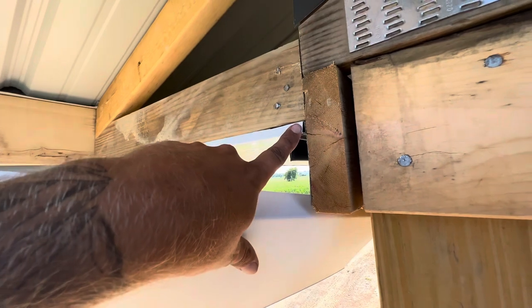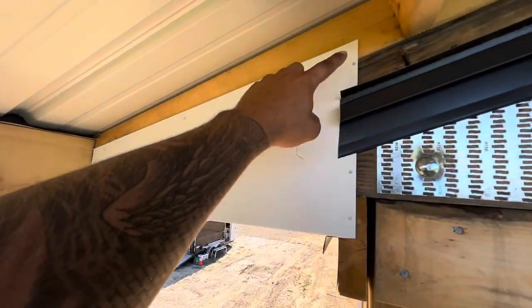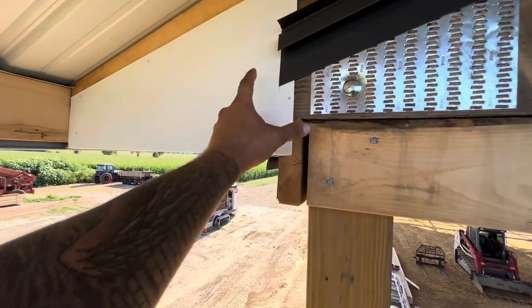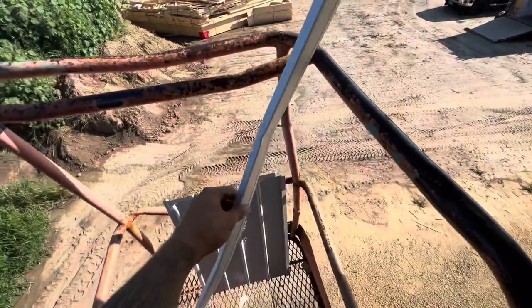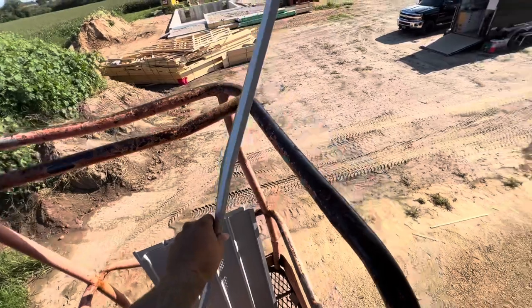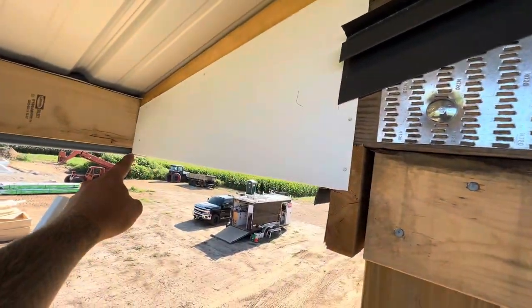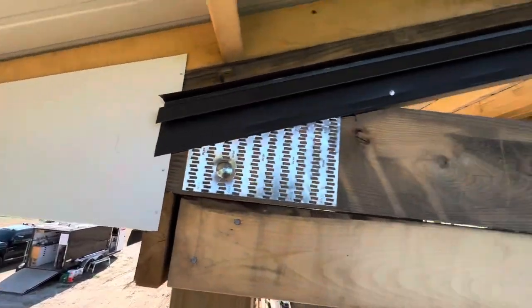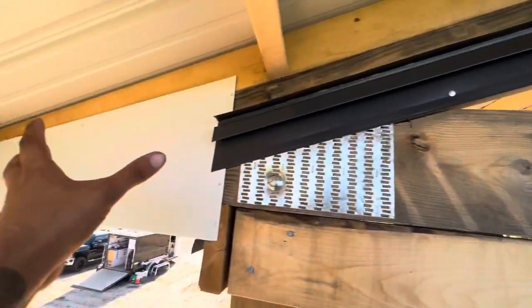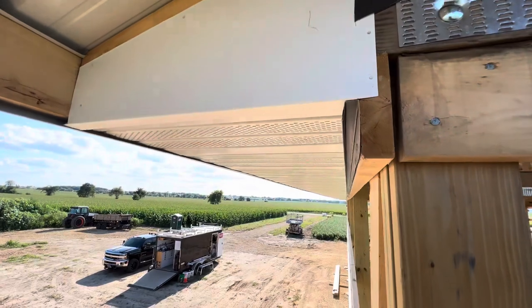It's just a little tight right here but we'll make it work. The panel is fastened off — a couple nails there, a couple going up the top, and some in behind where the corner will come up. Now I'm going to take some scrap regular half-inch J-channel, cut it to fit from here down to there, tuck our soffit piece in, and work this soffit up so we have a really nice clean transition from our rake soffit to our flat soffit.